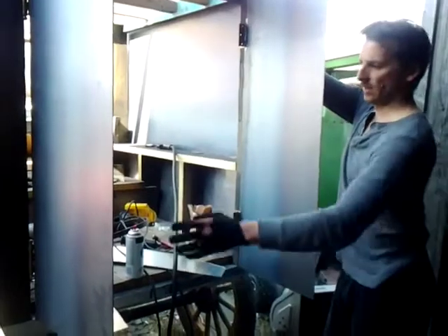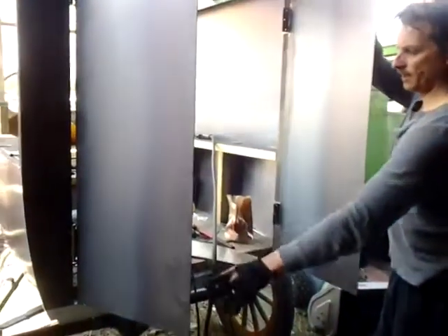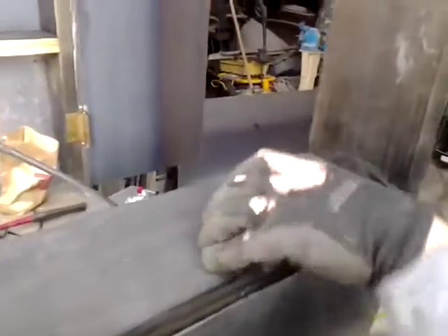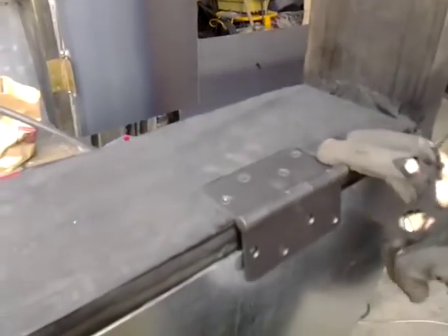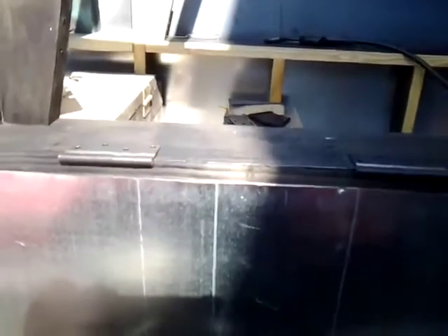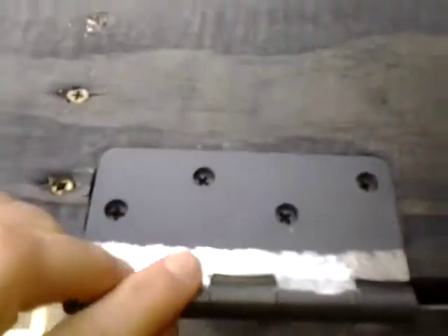That way it gives it something to bind it to where it'll butt up nice, and I can trim it to fit tight. It worked pretty good. I just flushed out these hinges here along here, and I did four on the bottom and four on the top, because again, this is eight-gauge steel - it's very heavy. The top ones aren't in yet. What I have to do first is weld them on to the hinges just like we did out here. There are these ground-out spots, so that's where the weld will be.